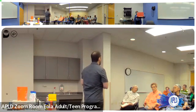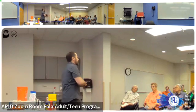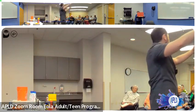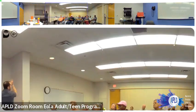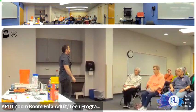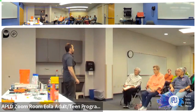They're really popular now. Do you recommend those? Yeah, heat pumps are great. All a heat pump is, it's a little tricky to think about. An air conditioner, right? We take the heat from the house, we put it into some refrigerant, and we cycle that outside and blow it into the air. Inside, it's 70 degrees. Outside, it's 105. But we're taking the heat from inside, and blowing it out.